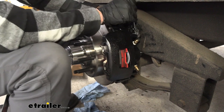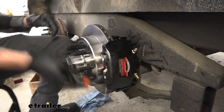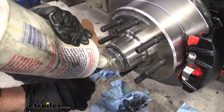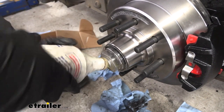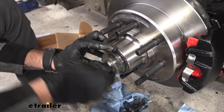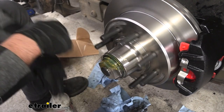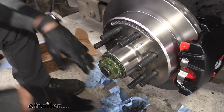Next, I'm going to take a half-inch wrench and fully tighten these down. Now we can pop off our little cap here and go ahead and put some oil in. We're going to fill it up just to the bottom of our opening, then spin it around a little bit and let it leak into the bearings and lube everything up. It's a little cold so our oil is a little thick right now, so I'm just going to let it sit upside down and let it leak down and get into everything. We can go ahead and repeat the same process at each brake hub.